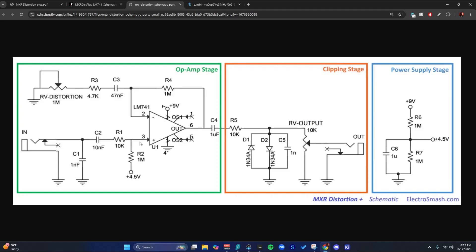R1 — I don't know how important this is. I suspect you could remove this entirely and you wouldn't hear much of a difference. If I'm wrong about that — because I do have doubts — leave comments telling me what an idiot I am. Why do I care about R1? Isn't our impedance here basically infinite? Anyway, this is our biasing resistor just to keep our op amp operating in the middle, from our 4.5 volts that we made over there.